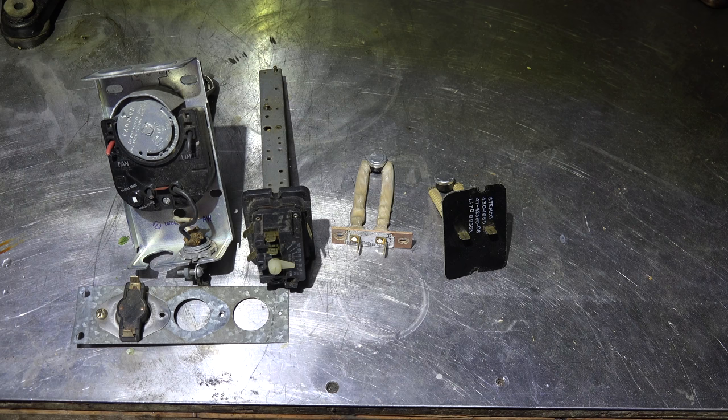Why do they kick off? Because you didn't have enough airflow. The most common reason is a plugged filter. If the limit hasn't worn out and failed completely, putting in a new filter will get it working normally. The symptoms are: the furnace comes on, runs about four or five minutes, then shuts off. The fan continues to run but the burner shuts off, and with the burner off it cools down.